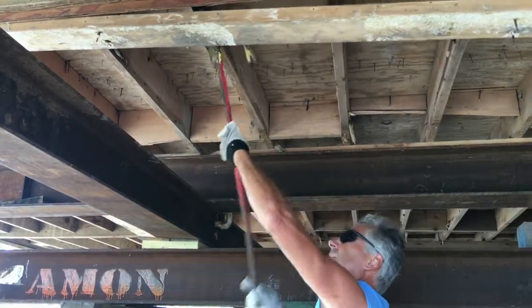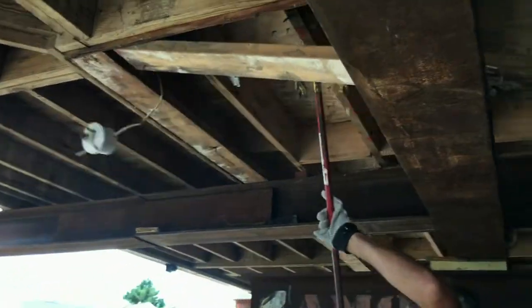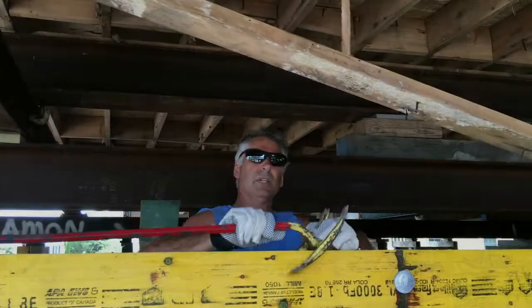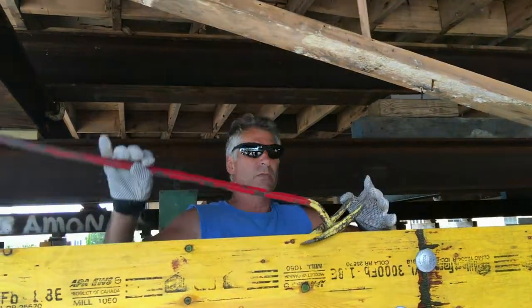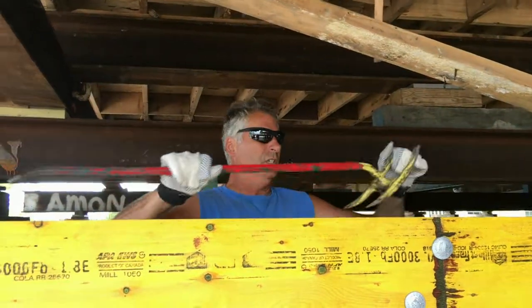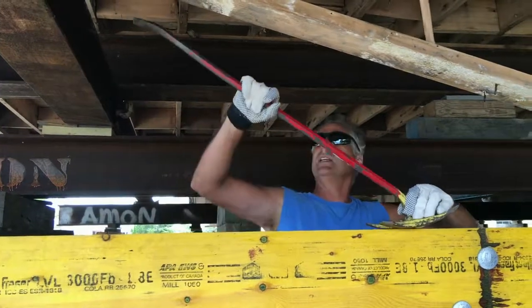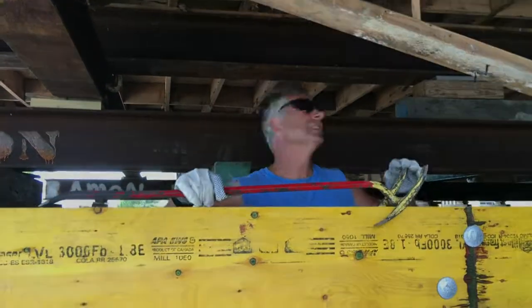Time-consuming project. Take this board down a little at a time. Pretty much all there is to it. Nestorbar fits evenly over top of this 3.5-inch banding beam. We've designed it that way so it'll fit over top of a 4x4. So if you're taking up decking material and such, you can always get this in here. The crossbar acts as your fulcrum point, and you get lifting for any type of decking material that you might be bringing up.